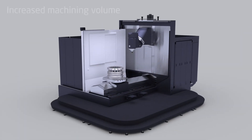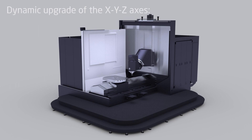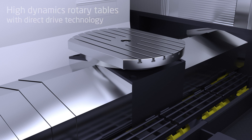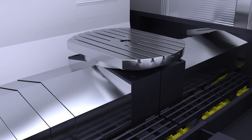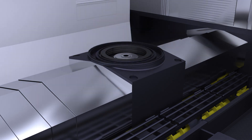Generation two has recently been launched for these five-axis universal machining centers. Key improvements include direct drive on all axes, torque motor on the table, increased acceleration and speed, and an increased working volume. In the T12 model, the maximum part height is now 1.6 meters. Precision has also improved to 6 microns on all linear axes and 5 microns in repeatability as standard, with enhanced options achieving 6 microns and 4 microns in repeatability across the entire working volume.